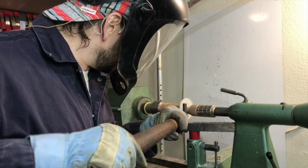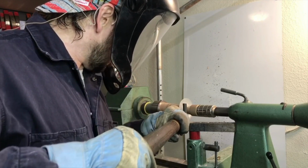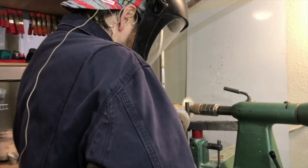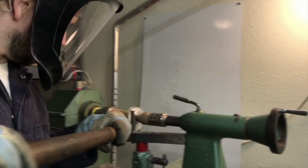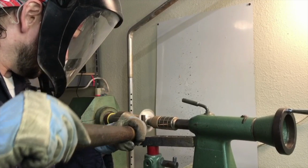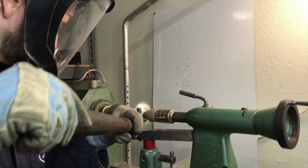So again, I'm going to get the tool in there and make sure that the blank is seated nice and firmly against the base of the chuck for forming. Then I'll slowly work my way out to the edges. But I really want to get in there, make sure it's nice and firmly up against that chuck so it's not going to shift while I'm working. And then the rest of the time you want to go very slowly because the amount of force is very little, and so it's easy to use too much force and cause the blank to wrinkle as you go.